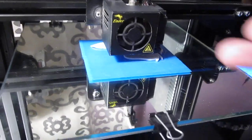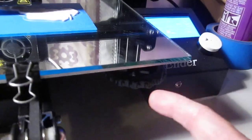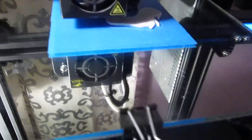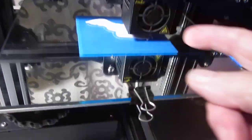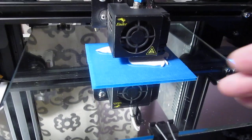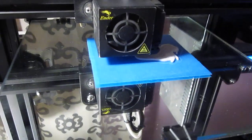The mirror tile, cut to size. It's removable from the print surface, from the metal plate, because you don't want to disrupt your tramming. You don't want to disrupt the knobs by taking the part off from the table while still on the bed. Take the clips off, remove the plate, put another mirror tile of the same thickness, set up as you see here, and start the print. It takes literally one, two, three, and it's back to printing.